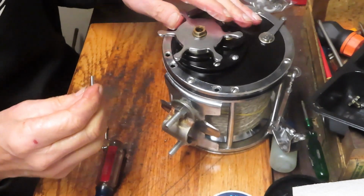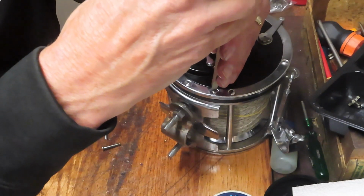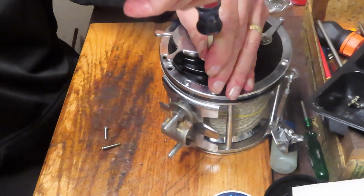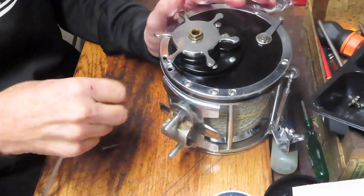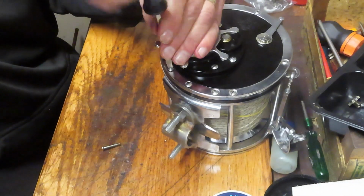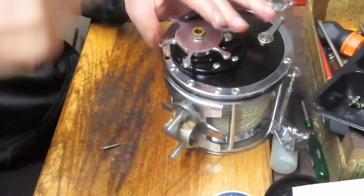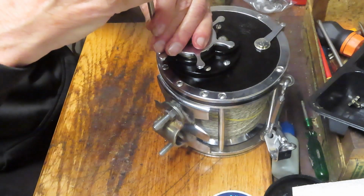If you want to do it, I would tell you to go ahead and use a mechanical screwdriver, but leave the screw proud. Leave it a couple of turns short and finish those last few turns by hand. That way you reduce the risk of shearing that head off of the screw.